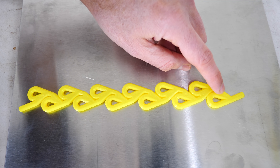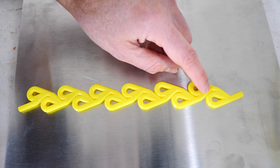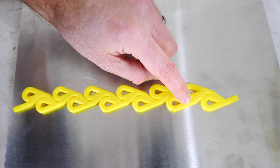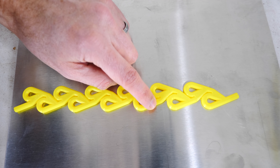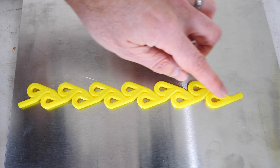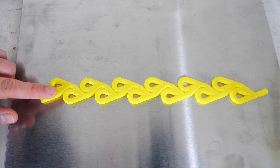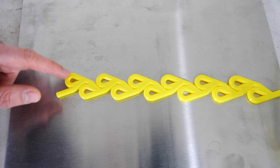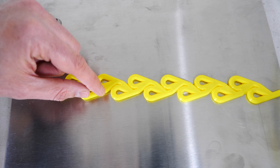The fluid that comes through here is going to split up again, and some of it's going to go this way and some of it's going to go that way. They're going to meet up again, so everywhere you have one of these loops it's going to cause more turbulence and a higher resistance through the tube. Whereas if you're just going this direction, there's not a high tendency for the water to loop back on itself, and it doesn't cause vortices.